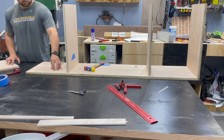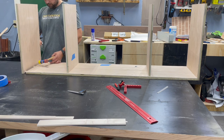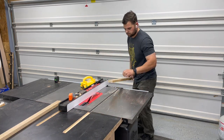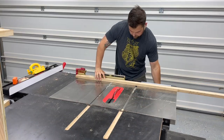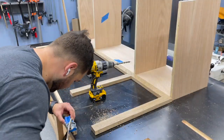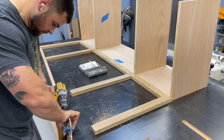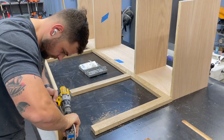This is going to get a four-quarter white oak face frame all the way around to hide all those plywood edges. Now that we know the exact size the face frame needs to be, I'm going to run all that white oak through the table saw, ripping everything down to width, and then using a stop block on the miter gauge to cross-cut all my pieces to length. Once those were cut, it's time to hook them together. For face frames, there's no reason to go elaborate — literally just using pocket holes. You'll never see these, they're all on the inside, and for face frames this works great.